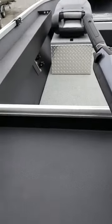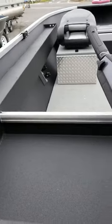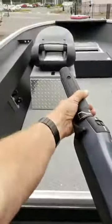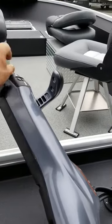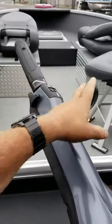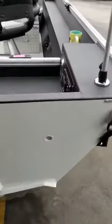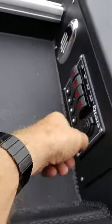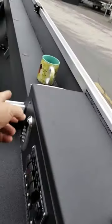You got a VRM — that's Variable RPM Module. It gives you from about 600 up to around 800 RPM on this style. Of course on these, you always have to make sure it's all the way back before you shift it. If it's in gear, it ain't going to start. If the safety line ain't in it, it's just going to crank but not start. Take a 12-volt power point, you got a horn, bilge pump works, nav lights work — check those out.